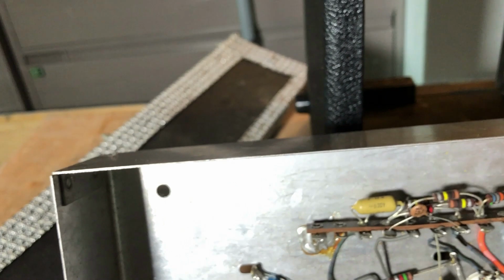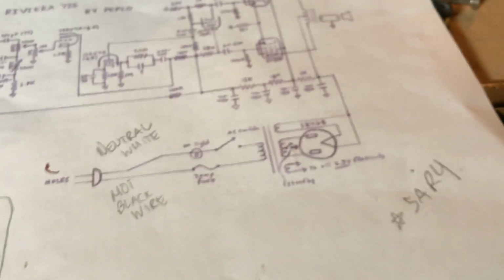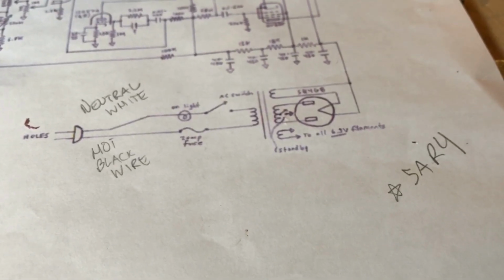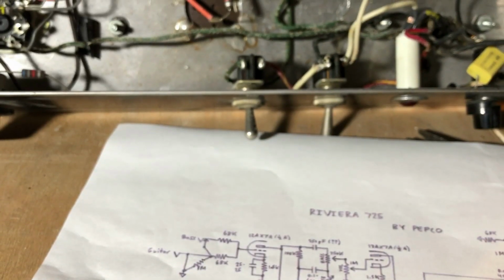It says 0.047/10/630. And W89. I'm assuming that 630 is 630 volts. And 10 is the number of years it'll take off my life if it doesn't kill me. So where would that be then? There's the crazy cap. And why would it be tied into? So that's sort of like the ground. That's sort of common grounding, if you will.